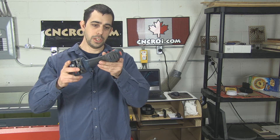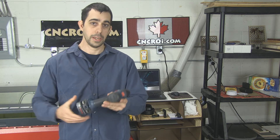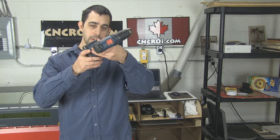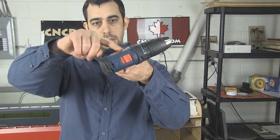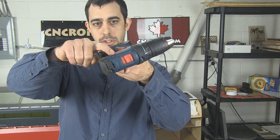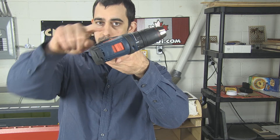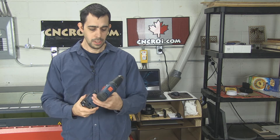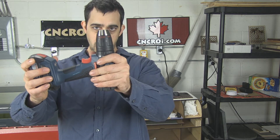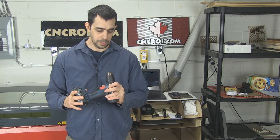So what you do is change the level of the tool, make a slight modification, and go over it again. The advantage of our Austrian CNC laser is that we can go over the same section more than once and it will be exactly the same spot. So if the tolerance is over to one side, it will engrave the first part but not the second part. The easiest way to fix that is to bring the table up a bit — now this part is in focus and this part is out of focus. Sometimes you need two or three passes and it's done. Same thing with the top: if you're trying to anneal it and it's a little bit off, there will be a difference in the engraving. That's why you may need to go two or three times over it to get a nice sharp engraving. We can go over the same section more than once and you will never know that we went over it more than once.